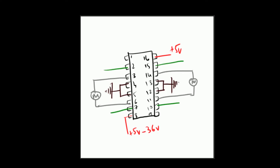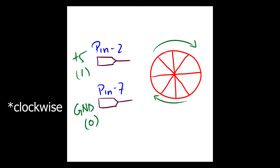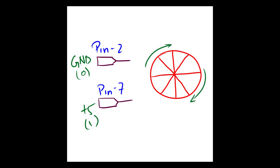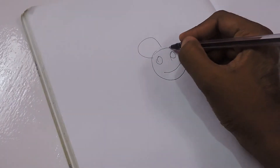To control the motors, pin 2 and 7 are used for the first motor, and pin 10 and 15 for the second. Pin 1 and 9 are the enable pins which can disable current to the motors. For more detail, you can check the datasheet of the L293D. We can control the rotation of the motor using pin 2 and 7: if pin 2 is high and pin 7 is low, the motor turns anti-clockwise; if pin 2 is low and pin 7 is high, the motor turns clockwise. You can stop the motor via the enable pins or by making pin 2 and 7 have the same input. In this video, we will be going with the second approach.